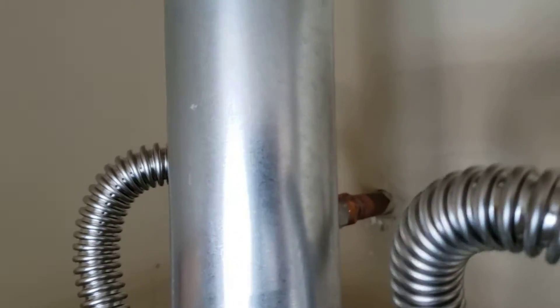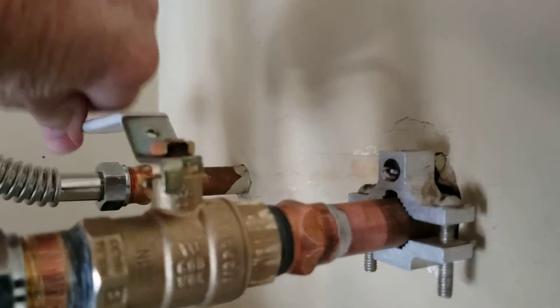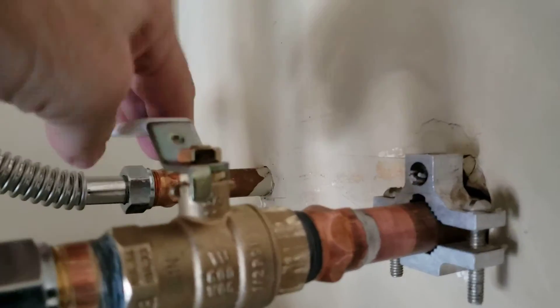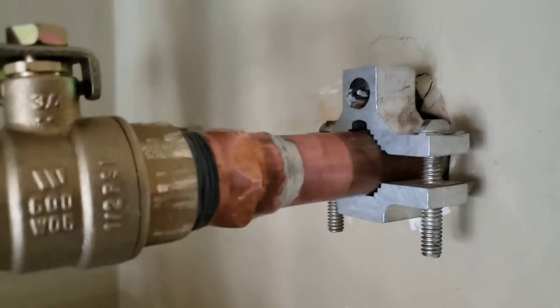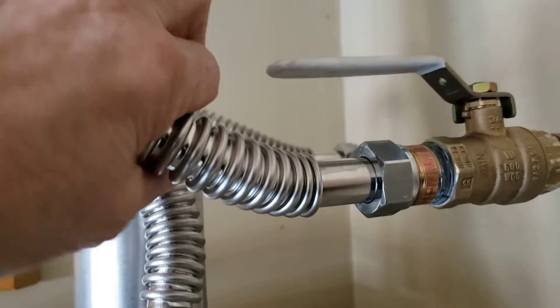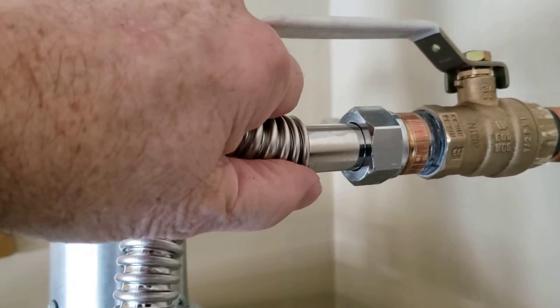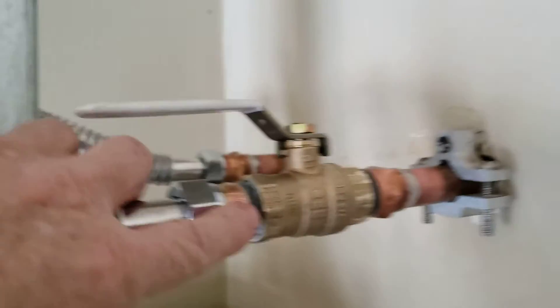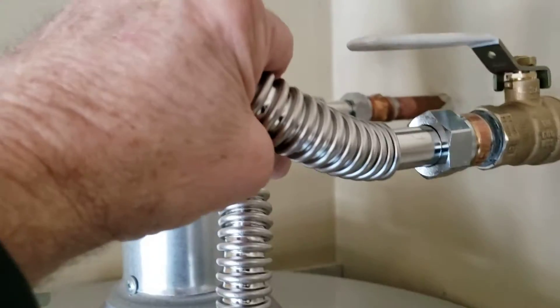Back up top: a little adjustable 90 right there, brand new, and a piece of pipe brand new. We gave you a new shutoff valve — took all the old piping out — a brand new quarter-turn ball valve, so quarter-turn on and quarter-turn off. That's a Watts three-quarter-inch full-port ball valve. A couple of copper adapters, one here and one there, a little brass nipple to a stainless steel connector — these are Falcon stainless steel connectors, full three-quarter-inch inside diameter, so this flows exponentially better than any other line. You did have copper coming out, so that flows real good.